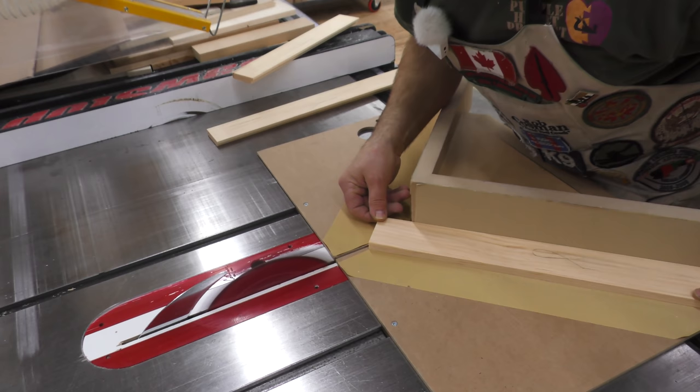But I've got to clamp it this way. Well, this is pine, so you can't clamp on that little narrow edge without damaging it. So by putting this piece of material right there, that'll just give me a little more clamping surface. I'm going to use these clamps just because they're medium duty. They've also got nice pads on them. And what I'm doing right now, and I'm going to do this up dry first, is to make sure that all of our miters fit perfectly. And we may have to go in and modify the last one.